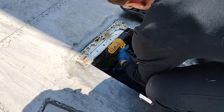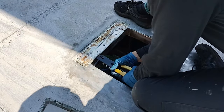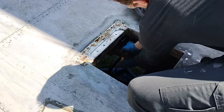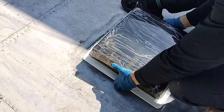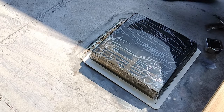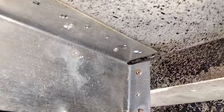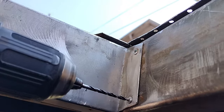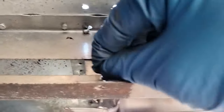Drilling holes for the new rivets. Now I'll stick this one-inch rivet in there. Filing back the sheet metal that now hangs over, and another test fit — just this back corner. So now it's not fitting this way. Drilling out the rivets holding in the side bracket. I'm going to take out the rivets I just put in, then put rivets in the new holes for the bracket.